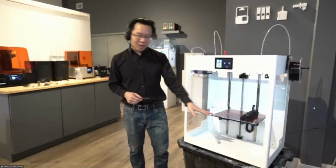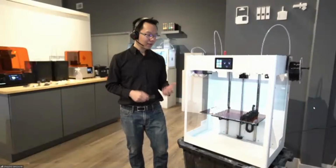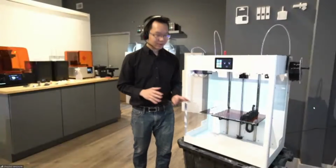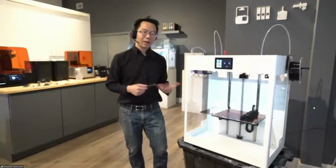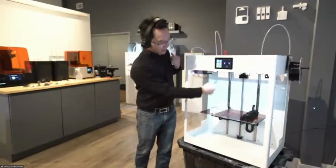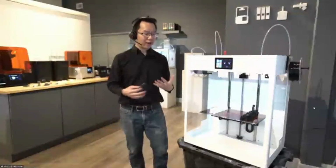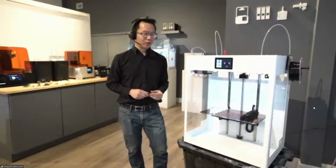There's a few other things too. The magnetic bed, I would say, is the most unique. That's not a bed that I've seen on other similar types of printers. At least the magnetic plus Kapton combination is quite new. I mean, we've seen some other magnetic beds and whatnot, but this particular one is quite different. The other thing too is it's got linear rails, so it makes it a lot quieter. A lot of other printers use just rods, but this X gantry is on linear rails, and so is the Z. So that's where I would say is quite unique. And it's just the combination of the size and Idex, which you can usually only get on a much more expensive printer. So I would say that's probably where it's the most unique.